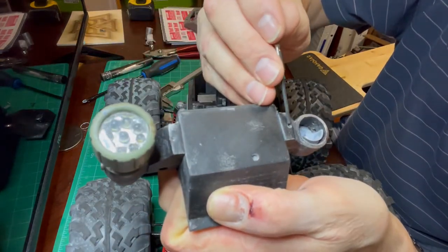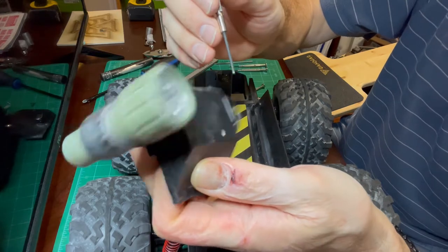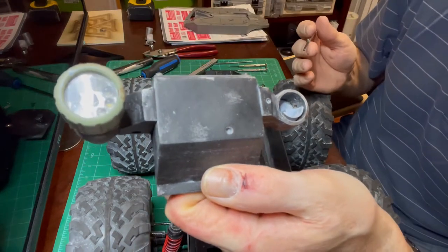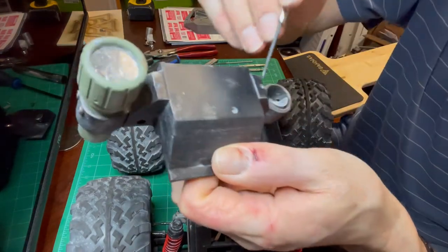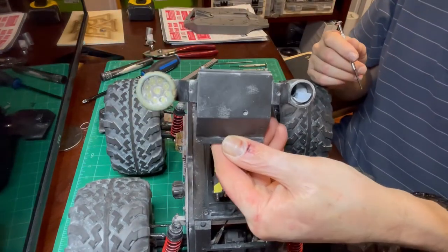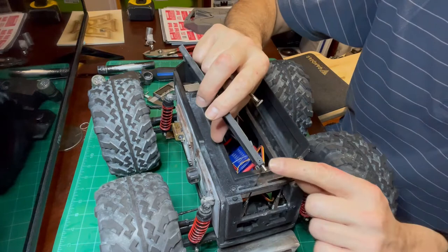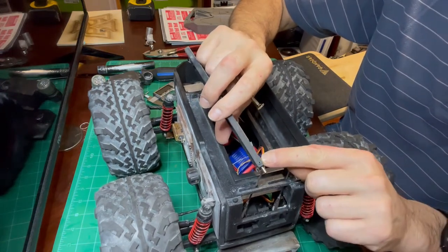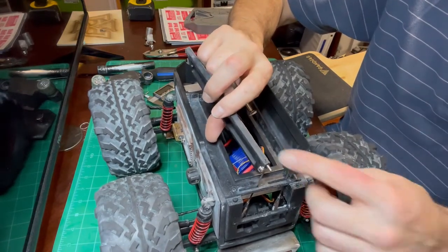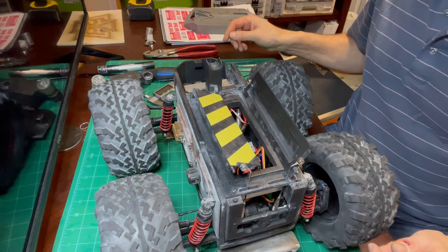There's a grub screw in there and a grub screw in here — both M3. And this is an M4 screw — I just put an M4 screw in there. I'm guessing they had something in there because it sure looked like there was a bottom to it, didn't look like just a hole, so I put a screw in it and it actually looks pretty good. On the doors, with the shaft in place, there are holes on both sides — you can flatten the shaft and put in grub screws if you want. I put the grub screws on the outside only just for looks — really the shaft doesn't move and it's not a big deal.